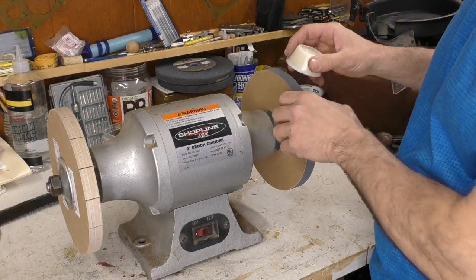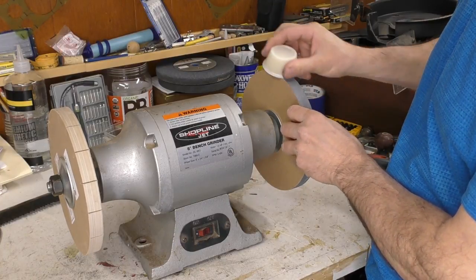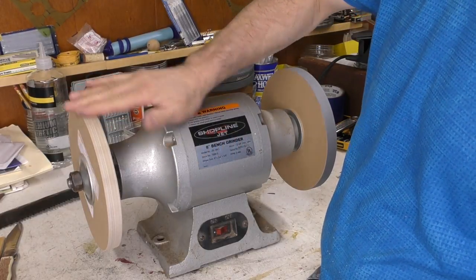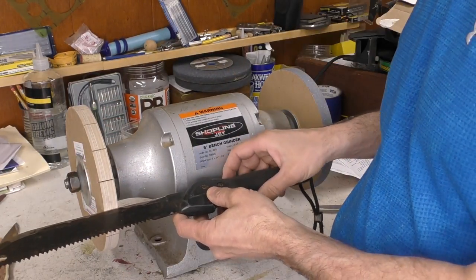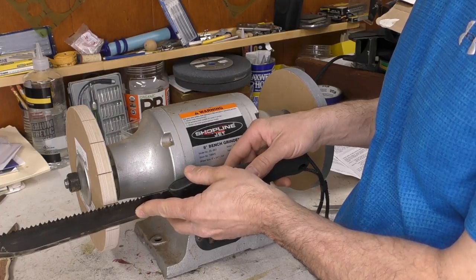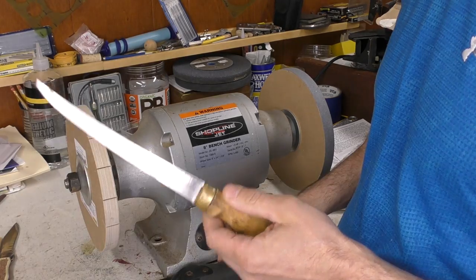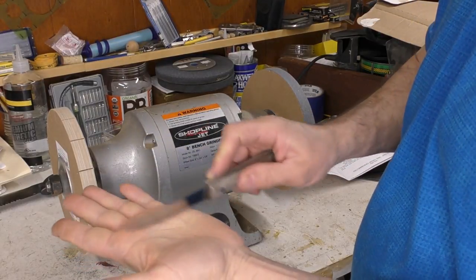Directions say to take a little bit of this yellow wax and just get a little bit on the grinding wheel until you see some streaks of it. Said to be careful not to put too much. The wheels seem to spin pretty true - this one has a very slight wobble but that's not really a worry. The main thing is if the surface is smooth when it spins. Coming straight out would be 90 degrees; half of that is 45, and half of 45 is 22.5. For most of my knives I want them at about 18-19 degrees, and for hunting knives about 20 degrees.